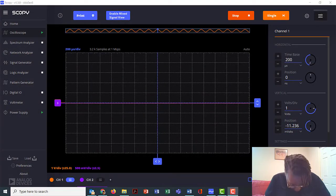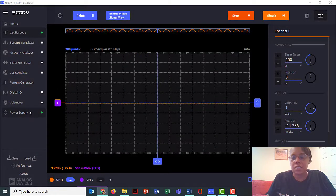Here's my first fail. I thought I was super careful wiring this up, but close but no cigar — I got nothing. I've turned this pot totally clockwise and totally counterclockwise, and I'm getting no signal. I now need to step back and check the wiring for this whole thing and see if I can figure out why my oscillator is not going. The oscilloscope is on. We're going to try this again. What we found was wrong was that pin 1 of the op amp is just saturated with stuff, and there weren't enough nodes for me to get everything on pin 1.